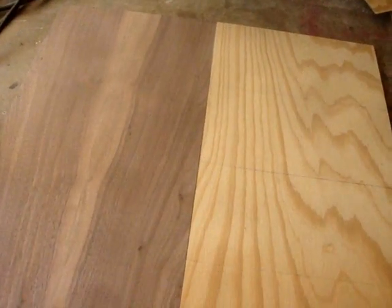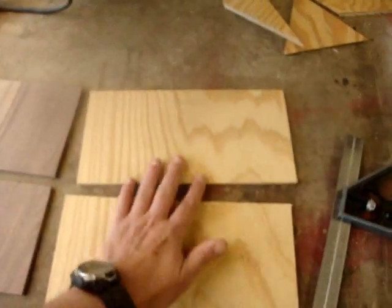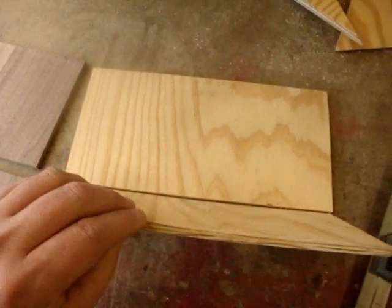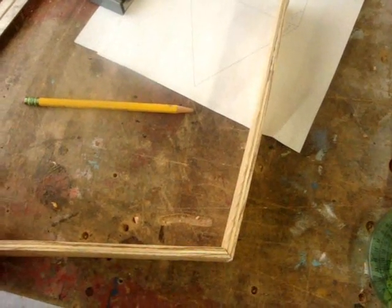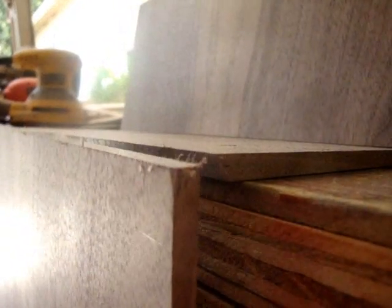Because I'm a little unsure about how everything is going to fit together, I'm going to be making two at the same time — one out of quarter inch plywood and then my quarter inch walnut. This is where I start to get confused: the little bevels where everything meets up. I'm going to start with the back and the seat of the chair. I made another little plywood template and determined this angle — I don't want it 90 degrees, I want it slightly back — is 100 degrees. There's my 40 degree bevel for the back. Now I need to cut a 45 degree bevel on this, which will be the front leg triangle, but I'll do the bevel first where it meets up with that bevel, and then cut out the triangle.